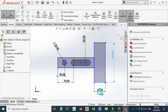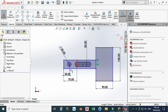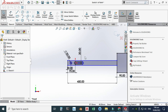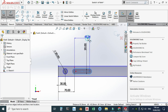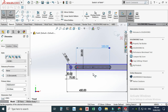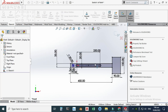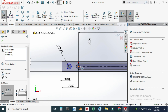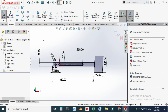The dimension from this edge is 70 mm. Select this line and this line and make them collinear. Also, this dimension is 150 millimeters and this one is 90 millimeters. The dimension from this to this is 450 mm, the slot length from center to center is 250 millimeters, and the width is 35 millimeters. Select this one, select this one, and make them horizontal — now it is fully defined.